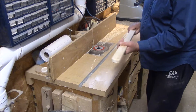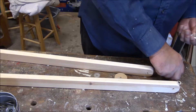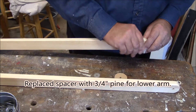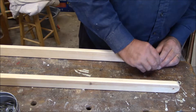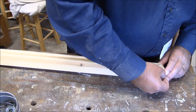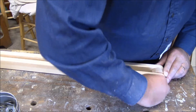That was a quarter round-over — just gives it a nice feel. Here we're about ready to assemble. I've got a bolt, washer, going through my stock. I'm using a nylon washer, made up a spacer, another nylon washer. I'm putting on a wing nut, but I'm sure I'm going to go to a knob because we don't get a lot of torquing power with a wing nut.